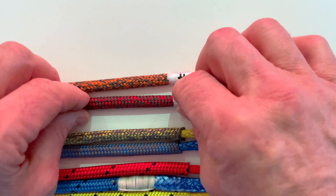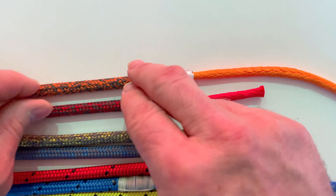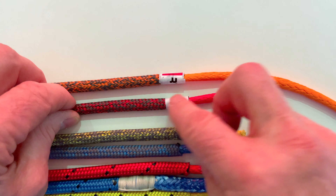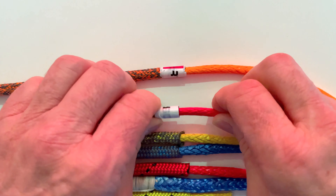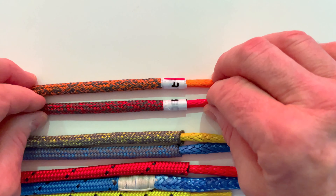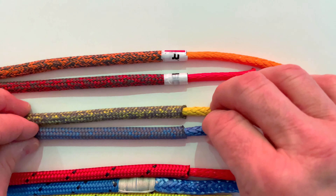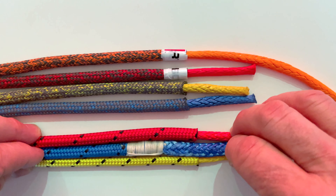For the best, we've been selling this as Halitec for a number of years. The outer jacket mixes polyester with Technora. Technora has two properties: it's very good in wear resistance but it's also very grippy, so it tends to grip the inner core very well and prevents any creep. We've been suggesting these lines are used on halyards that are fixed where you don't want creep or slip, and also in spinnaker sheets and a number of control lines because of their strength properties.